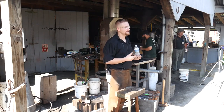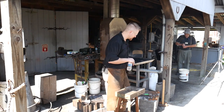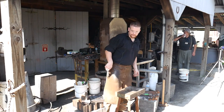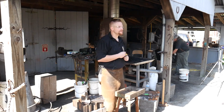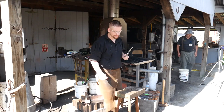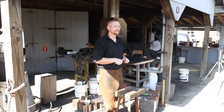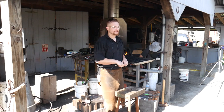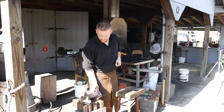Just mild steel, to the best of my knowledge. It was bought at the scrap yard two days prior to coming here — just prepped by me, flat disk. You don't have to have anything special for a swedge block. A lot of my tooling is mild steel in my shop unless I'm going to be using it for a lot of replication, because a lot of my work is custom — it's like a one-time deal. I'm going to use that tool once and never use it again, so there's no point in spending fifty bucks on tool steel.